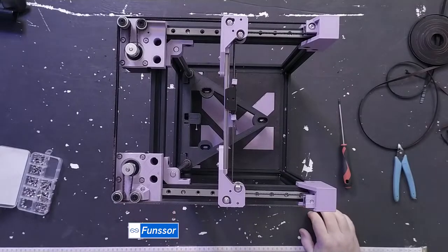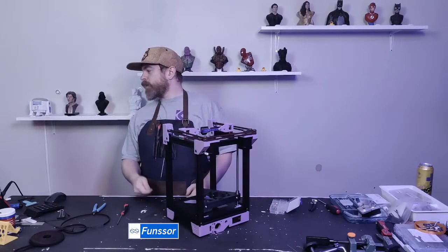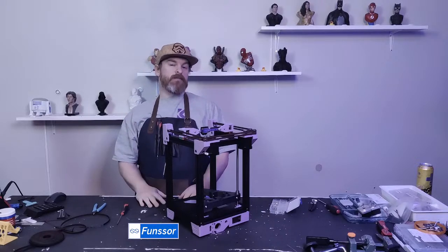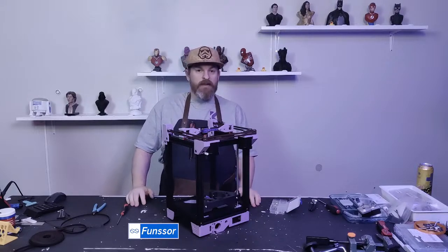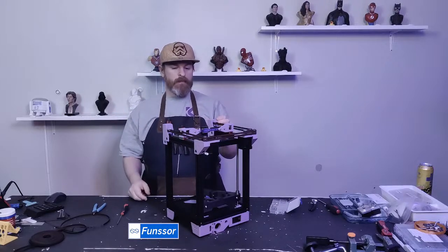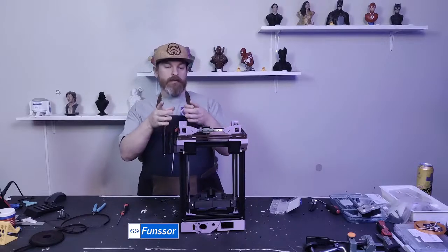So you can recycle PLA quite easily if you have an oven and a baking tray. Smash up your parts with a hammer, put them inside a pillowcase, and put them in the oven at 230 Celsius and just leave it there, and they should just float down to a sheet of PLA that you can use as panels. That would be really cool. And you can just keep on melting them down to flat panels basically.